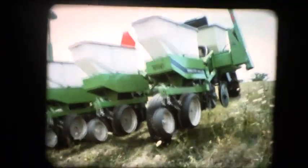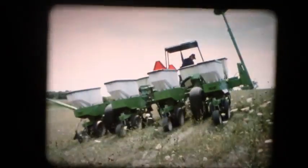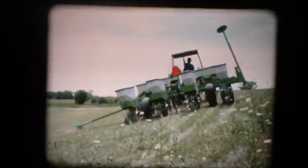For conservation planting, you have a choice of no-till coulters. They mount to the main frame, so there's increased down pressure. The exclusive torsion spring mounting assembly reduces frame vibration and shock, resulting in more accurate planting. Mounting the no-till coulter close to the planter unit improves alignment, which increases accuracy, especially for hillside or contour planting.